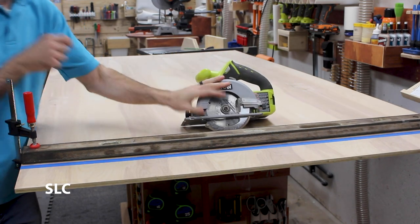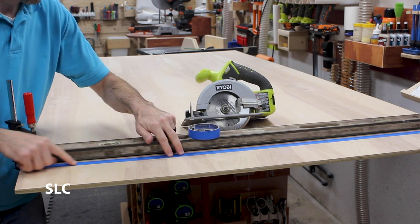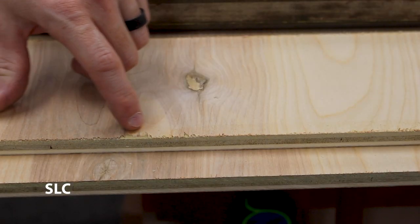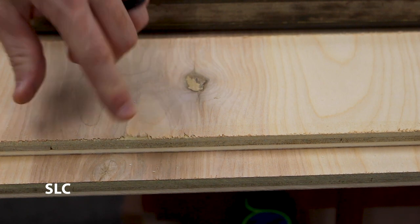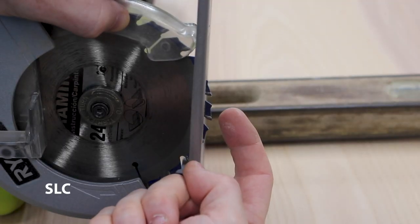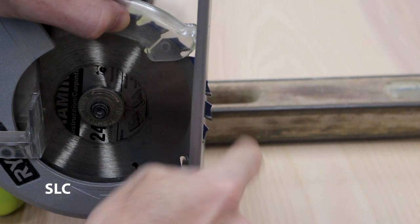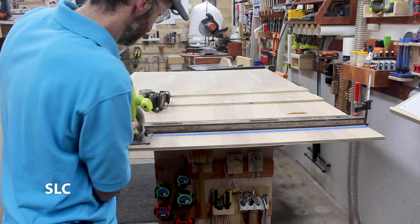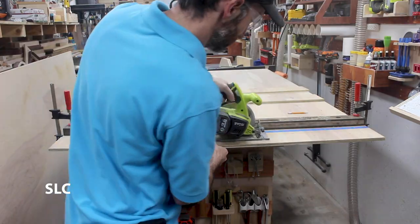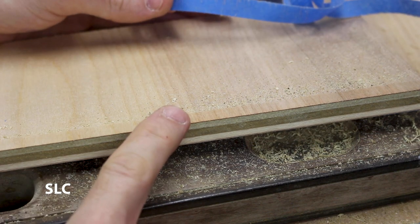To make this first cut I'm going to be using a circular saw, and I've lined the area with some painter's tape. This should help reduce tear-out when you make the cut. Sometimes you still get some blowout even with the tape. Here's another idea for an even finer cut: first set your blade really shallow — you're actually going to make two cuts. The first cut just cuts through the top layer of fibers, and then you make your full cut. Look at there, almost perfectly sharp.